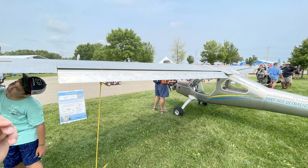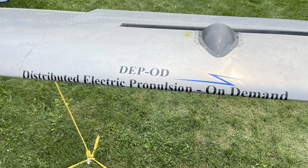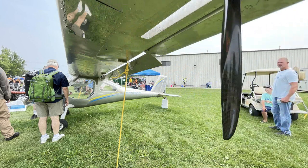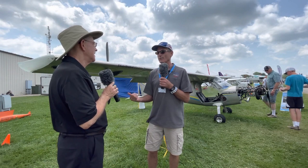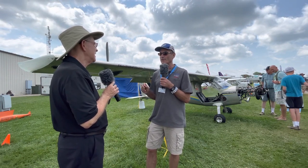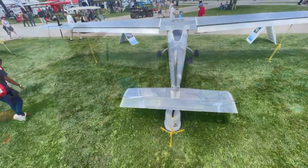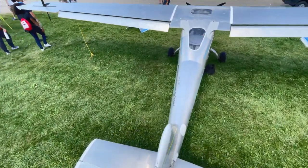We're starting out at nearly 200 pounds of thrust with the Pellini on the nose, and we're adding another 150 pounds of thrust. You can carry the whole battery for this in your hand because we're only using it for about 20 seconds at that climb rate. You would take off in 20 to 25 feet and climb over a 50-foot obstacle in the first few seconds. Then you turn them off and climb on the gas motor, using them just as a flight sustainer if you're motor gliding.